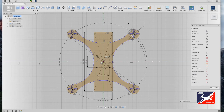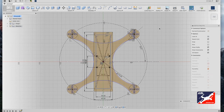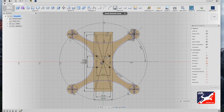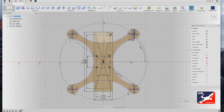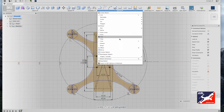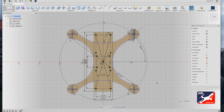Repeat this process for the additional hardware required on your motor mount plate. From sketch menu, center rectangle tool, from drone center drag out and enter 145 by 35 millimeters. Select the rectangle lines and hit X to create construction guides. From sketch menu, center diameter circle, from the top-right corner drag out and enter four millimeters. Right-select the circle, sketch menu rectangle pattern tool, enter minus 35 with quantity 2, then vertical arrow enter minus 145 with quantity 4, and hit return.